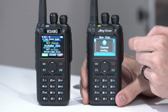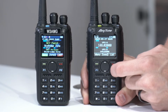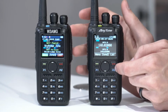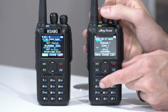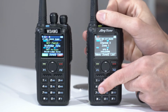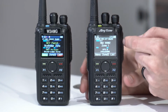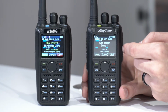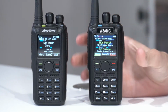Perfect. So there we go. It is saved. So now at this point, if we go back out here, we can get out of VFO by pressing P2. Now there is our zone, and if we scroll through here, if we're going backwards, it'd be faster. There we go, perfect. That is our channel. We can see it's analog, and it has all the information we were looking for. So now we just need to do that with our second radio, and we should be set.